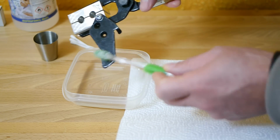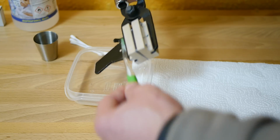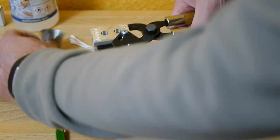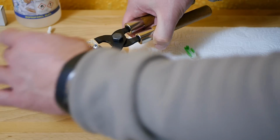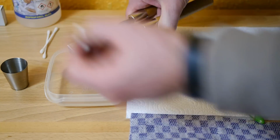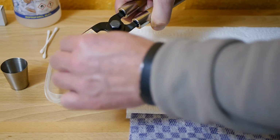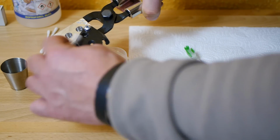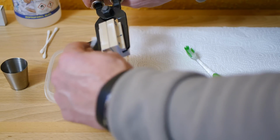Don't forget the sprue plate. There is grease to remove also. And then I use a little bit of fresh isopropanol. Okay, let's do it again. Now with new isopropanol alcohol, I fill the cavities, let it soak a little bit, and use a Q-tip. And the whole cleaning process here took something between 2 or 3 minutes. Just take your time. A good cleaning process helps casting better bullets later, so it's worth the time you have to spend.